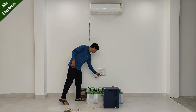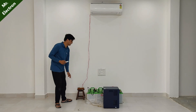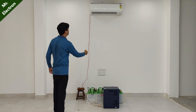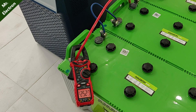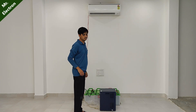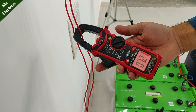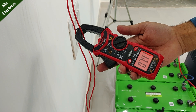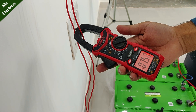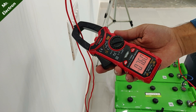Let's try and run my AC on my new inverter setup. As you can see, the drawn current is as high as 25 amperes at a 48 volt battery setup, and it can go to 30 amperes under maximum cooling. Also, the AC current drawn by my air conditioner is around 7.5 amps, and my inverter can handle a current as high as 13 amps, so we are still left with a lot.